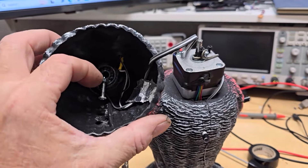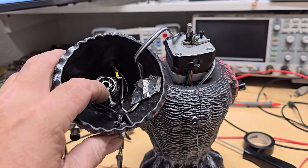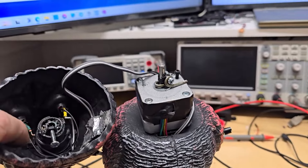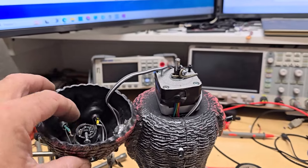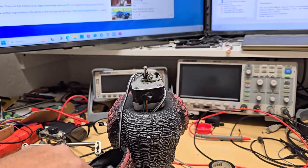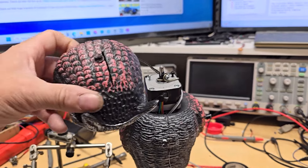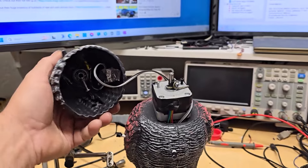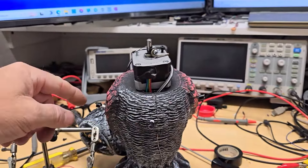So I just welded a nut and had to re-tap it again, put this little set screw with a little hole in the back so I can actually attach this to the shaft via the set screw. I was using tape around it trying to shim it out and put it on there, but it was slipping over time. That's what I just got done doing for the last hour, so I'm getting ready to put this back on but I thought I'd show a little video clip of that.